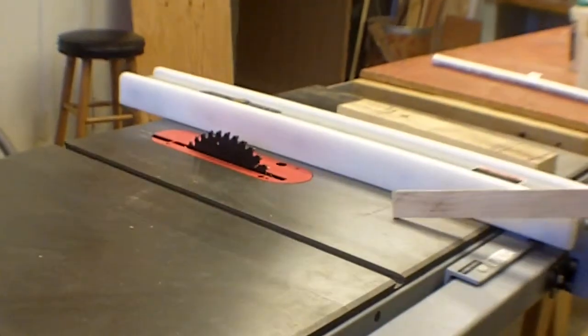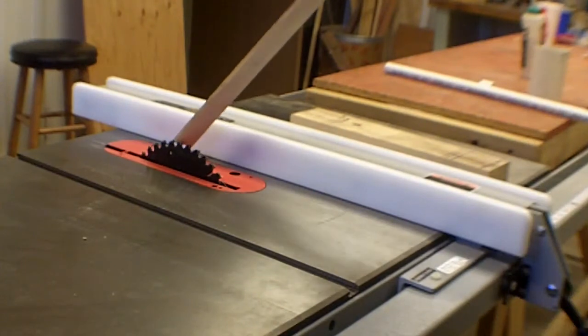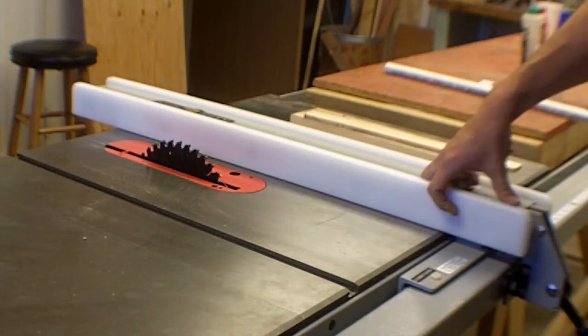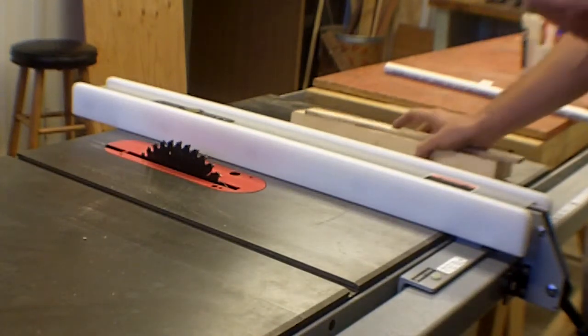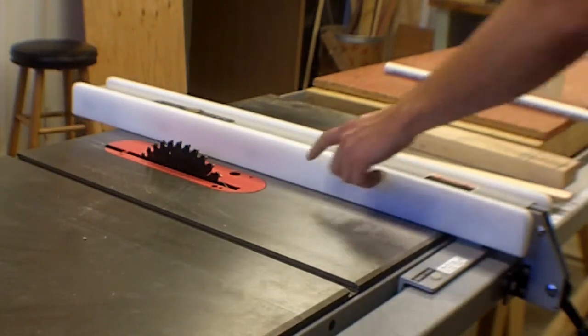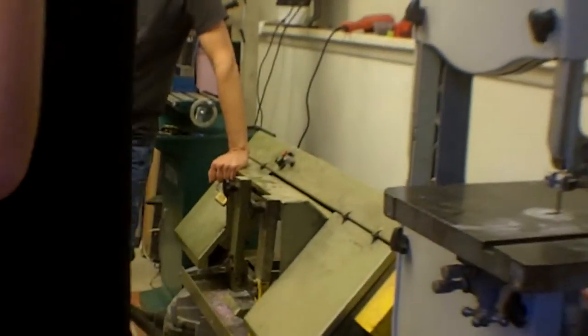This saw can cut metal with a different blade. The blade profile will change — number of teeth and shape of teeth varies. For example, it'll go through acrylic sheet just fine, but tends to tear out along the cut. A different blade type gives much better results on acrylic. Those specialty blades are generally much more expensive — about twice as expensive usually.